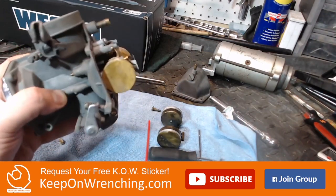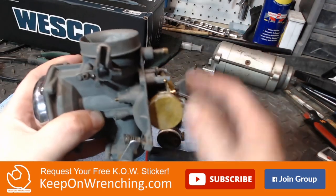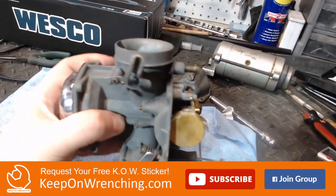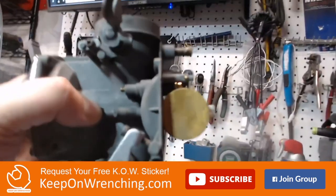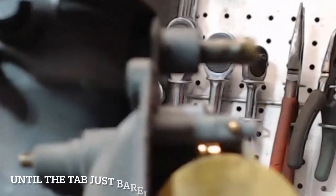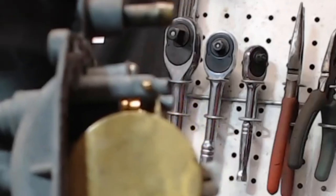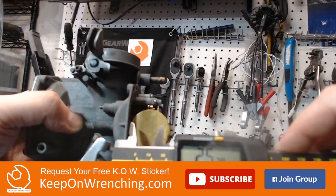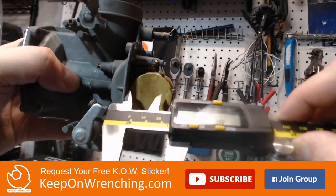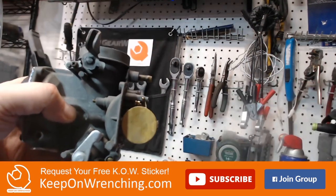What you do is tilt it and get a good light source behind there so you can see that little flipper. Just tilt it until you can see right inside of there — that's where you take your initial measurement. On this one I'm way, way high. That thing has to come down a lot because I'm not even close to 26.